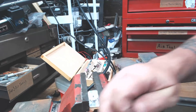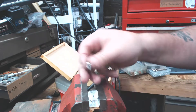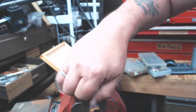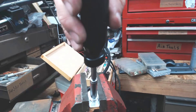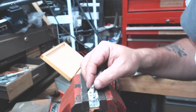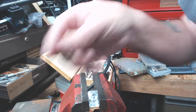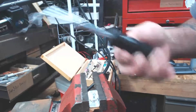Hopefully this is recording because I pretty much got one shot at this. The reason I'm redoing these is because of the hardware that comes with the cells — a little hex head screw. If I go down in here, that's bottomed out. I grabbed one of the bus bars here, and you can see the bus bar will still fit under it. So that's bottomed out.